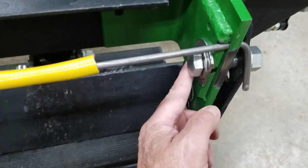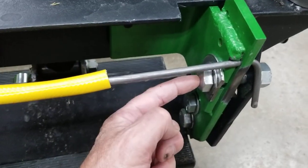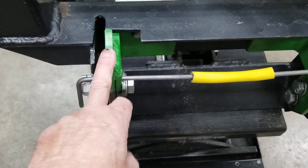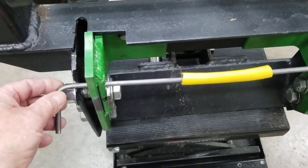These are 5/8-inch bolts, fine thread, tapped into this piece and screwed in tight. When I want to put this on, I put these in ahead of time on the tractor — these hold them in place — and then when I'm done bolting it up, I just pull these out.